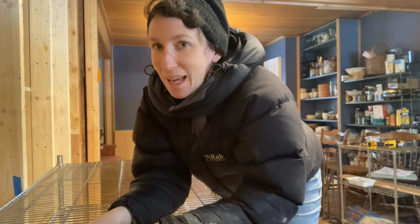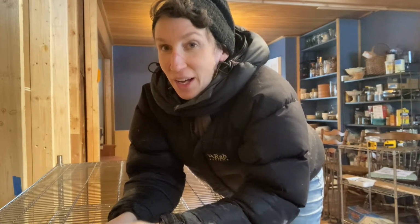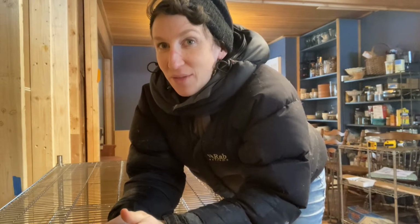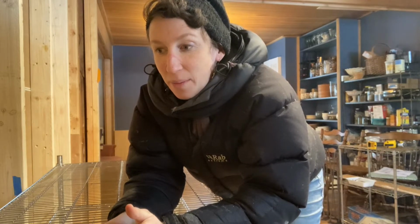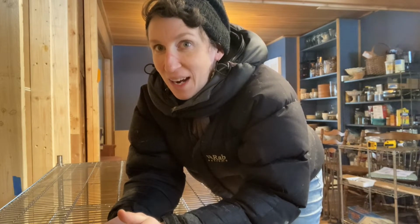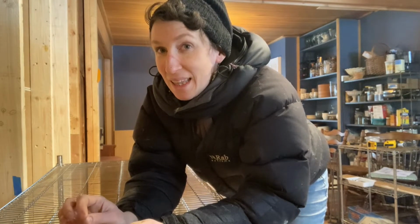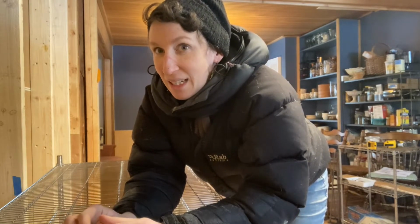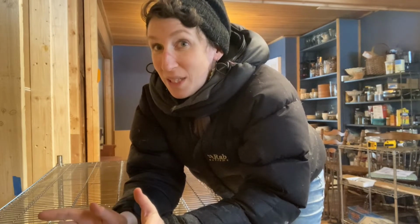Cutting the block for this countertop didn't go quite as well as I had hoped. The cross cut on the end was fine, but the rip cut has been really tricky, and so I'm gonna get a different blade and try it again another day. I was using a blade with 40 teeth, which I guess technically is a cross cut blade, and so I'm gonna get a blade with fewer teeth and maybe that'll help.